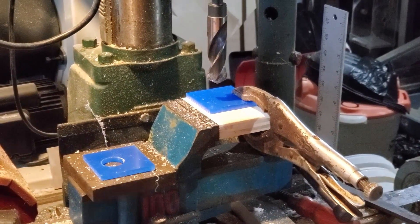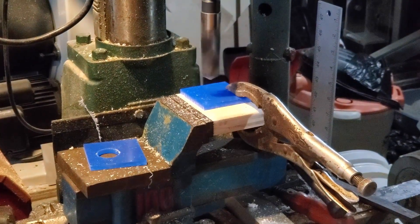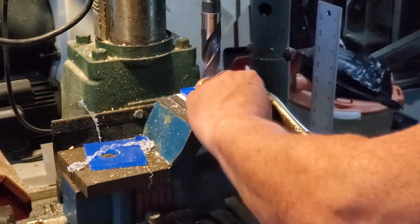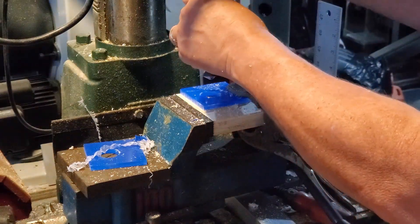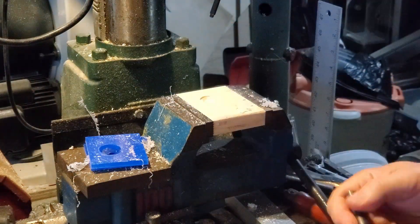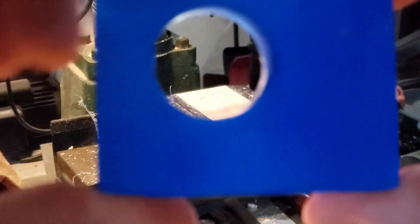What I'm going to do is double up the piece where the pipe is going to fit through, because I am going to hold this entire thing together with acrylic rods. For the connection points, I'm going to drill quarter-inch holes and then drive in a quarter-inch round rod. That's how this is all going to be held together.